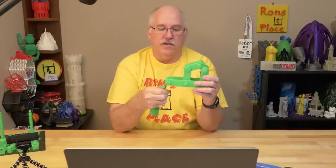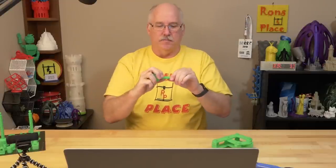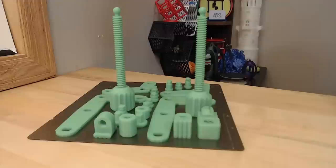So I just thought this whole thing was amazing and I printed this screw at only 15 or 20% infill and it just wasn't enough. And of course I'm printing this in PETg and it gives it a little bit more flex. But yeah, it was really neat. So then I had to print it again, and I decided to print it at 50% infill. And it turns out so nice on the bed that I wanted to show it to you all.